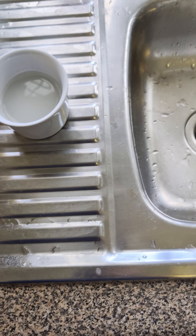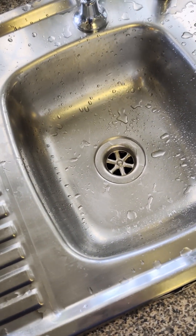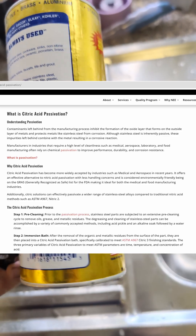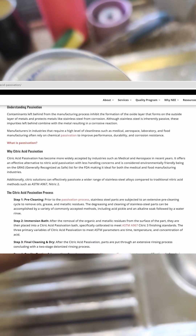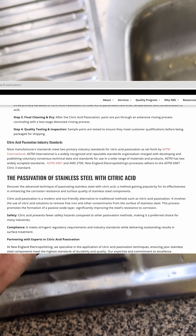But luckily I've been cleaning my sink with this stuff. This is Bar Keeper's Friend — it's really good for cleaning. But the magic ingredient is citric acid. So this is citric acid powder with some gypsum or some abrasive stuff in there, but citric acid can be used to passivate stainless steel.